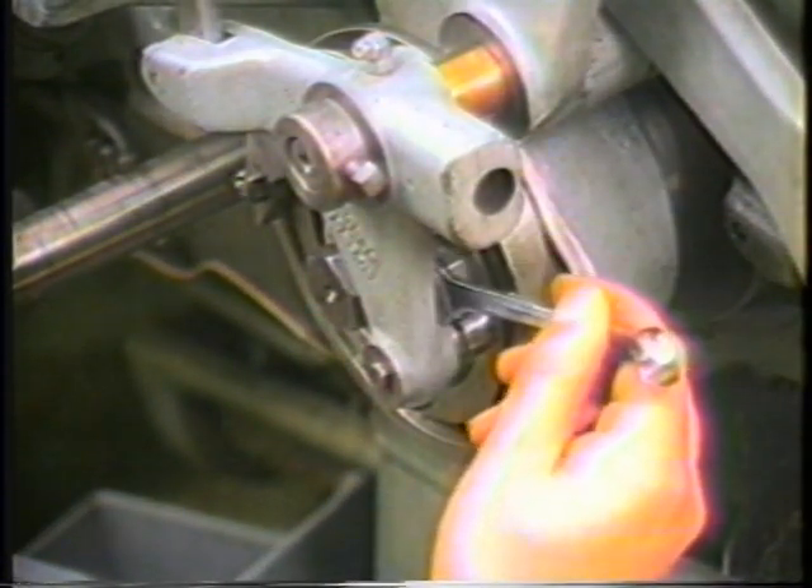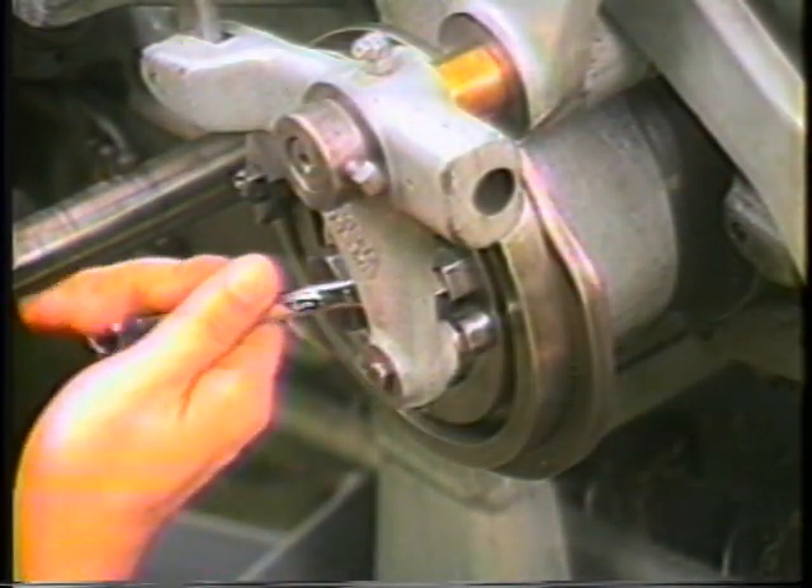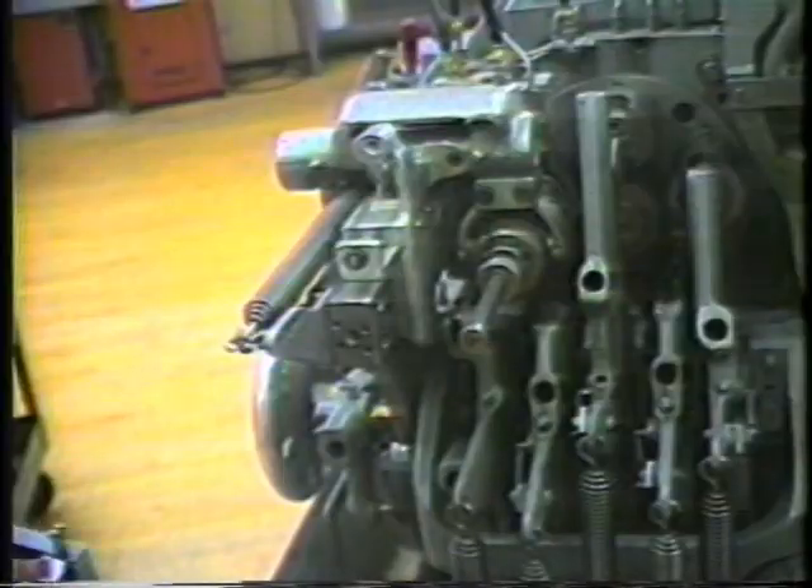Set the 1263-19-1 opening cam above and against the roll on the burring spindle collet opening and closing lever.